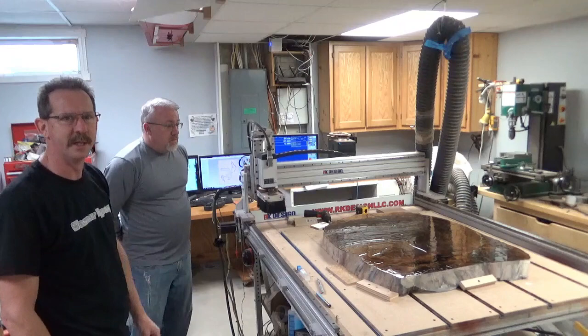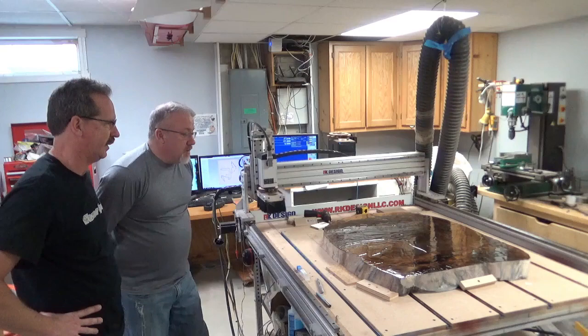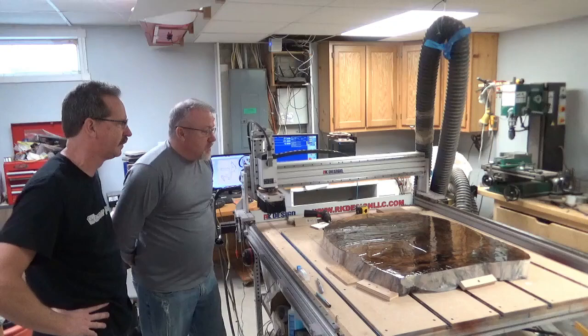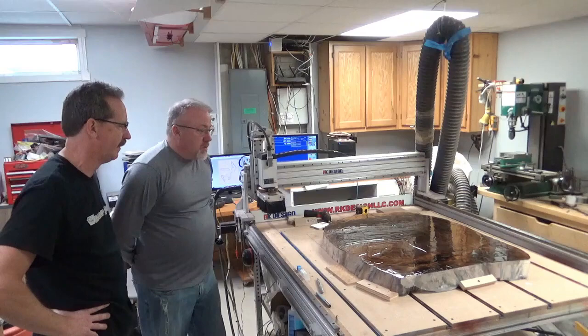Hi, I'm Rich Cryer from RK Designs, custom laser engraving and also CNC routering. Also do shirts. What we've done now is we've got the table flat, we've got it epoxy coated. We're going to do the cutouts of the inlays of the lakes. So we actually cut the lakes out of the parts doing a contour cut. And it's going to be a couple different cutters because it is almost 2 7/8 deep. So we're going to give it a whirl and see what happens.